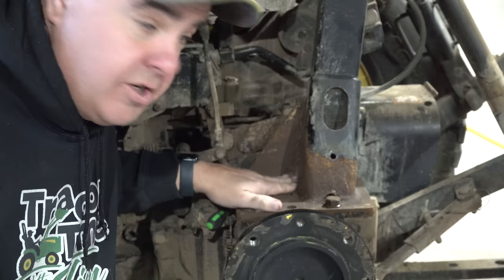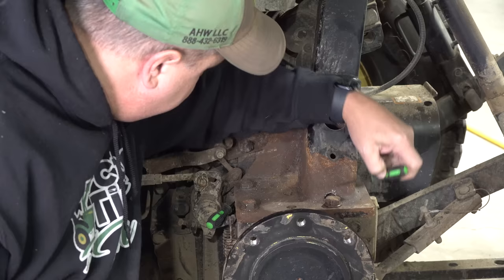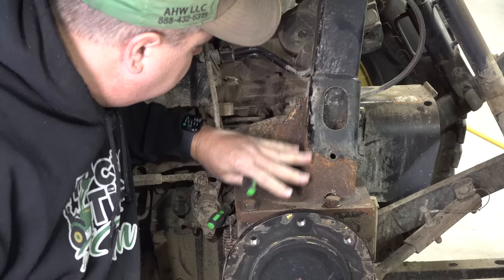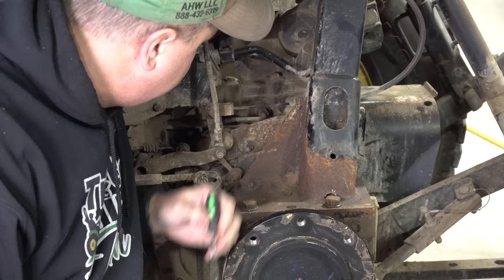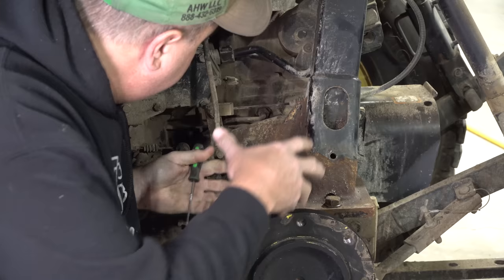So the axle runs out through here. There's hydraulic oil all the way out to this seal. Having not seen where this occurred, I wasn't sure whether it happened under here somewhere. Again, I've just now got to where I can get back in here. I wasn't sure where this contact was taking place. But one area that did seem really bad, I mean, this was caked full of dirt and all kinds of grime and stuff. It's almost impossible to wash in here. When the tires are on, they come all the way in to this area right here. You can't even hardly see this from the outside, let alone power wash in here. But these holes here, they go right down onto that aluminum transaxle or the outside axle housing here.